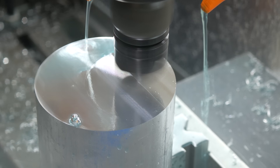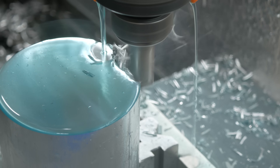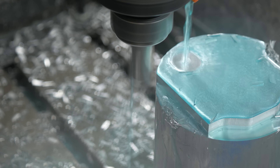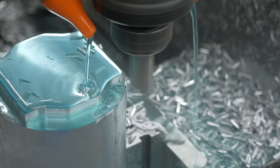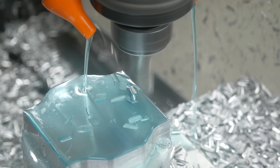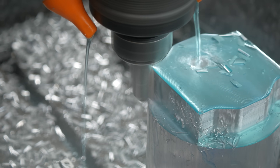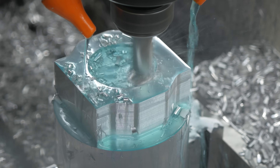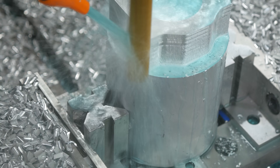After we probed the part, we're machining the top face off here. It might look like the part is sticking way out of the vise, but I'm going to machine almost all the way down to the surface of the vise. During this time using the Bridgeport, I had to run the coolant fairly low — it looks like it's just drizzling on the part. That's because my splash guard wasn't very good. Whenever I turned the coolant up to really blast the chips out — which would be the right way — I was throwing chips and coolant everywhere, making the floor slippery and frankly dangerous. So I found it was better to just let the coolant drizzle on the part. This is actually sped up five times, so I'm cutting very slow, but it kept me from making a mess and the part came out okay.